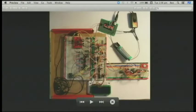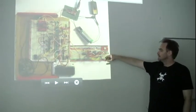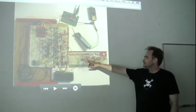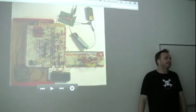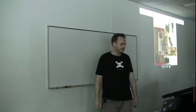This whole area here could have been done on a microcontroller but I wanted to do it in hardware. This generates interrupts when you roll the trackball and each of those interrupts comes in to a 4-bit ripple counter — so you're basically doing 1-16 counters that come out in parallel to a multiplexing chip, and you can then read the values from the ripple counter from the multiplexing chip over I2C. This was an overt attempt to actually do things in hardware. In software you would just attach that directly to 4 different pins on an Arduino and count things up in software.